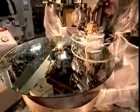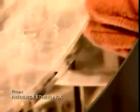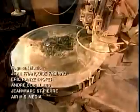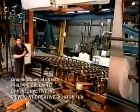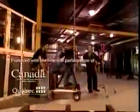To make beveled mirrors, they use what's called the shape bevel machine. First, it carves out the edge, then polishes it to a shine using concentrated cerium oxide, a stronger version of what they used earlier to clean the glass surface before plating it with metals. Mirror factories also ship whole panels to shops that do the cutting themselves. A fragile feat that's certainly not for the superstitious.